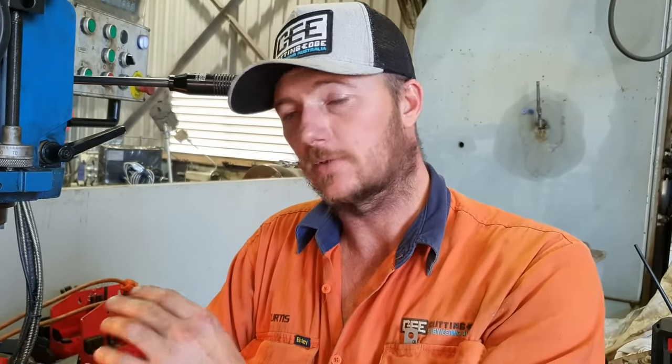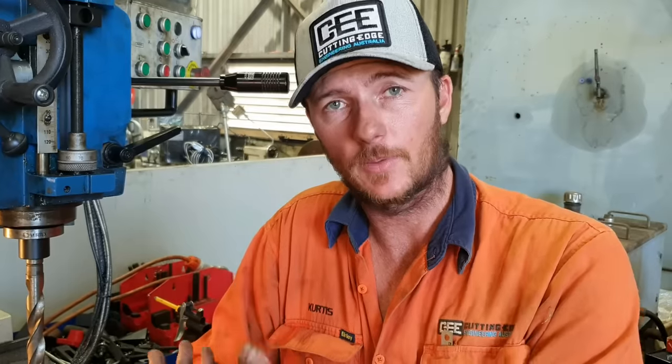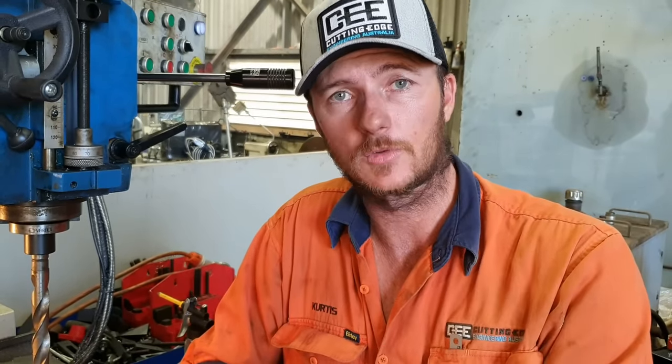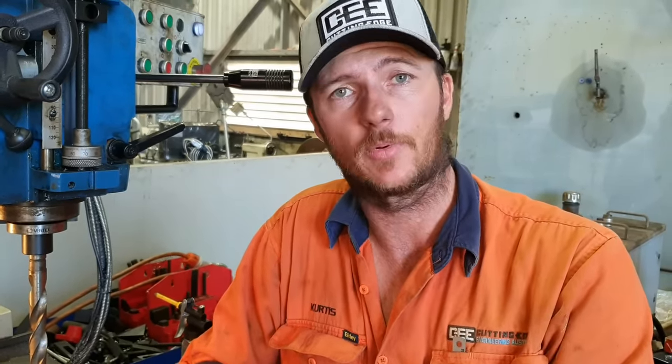We've got to weld prep one end. After we do the weld prepping on that end, I'll then take it out of the machine, I'll weld this fitting on, I'll put it back in the lathe after it's cooled down, and I'll do the internal thread for the cylinder gland. We've then got to flip it in the machine, we'll get the barrel end set up back, running true with the barrel, we'll tack that on, we'll pull it out, we'll weld it up on the rotator.